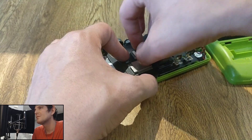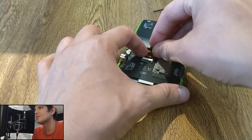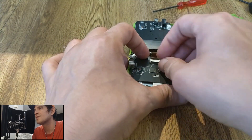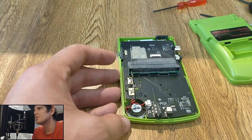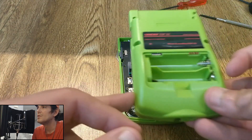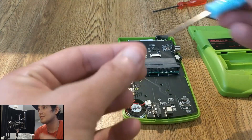I'm having a bit of issues here, but I'll get it in a minute — I always do. You just got to get it flat first, and there we go. Once it's in nice and snug, you just pop this back in here. For reassembly, there are only three screws that actually hold the PCB, and they're starred Phillips head. You can use the case as a reference — there are six holes in the case, and you can see where all six holes go.